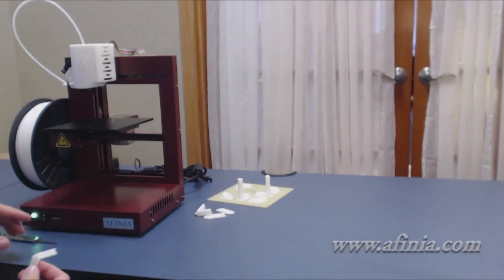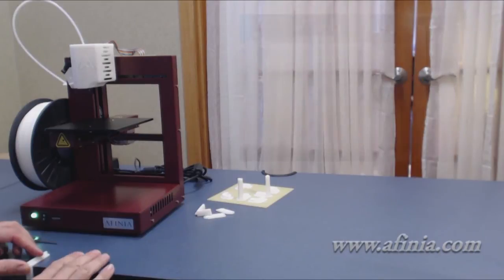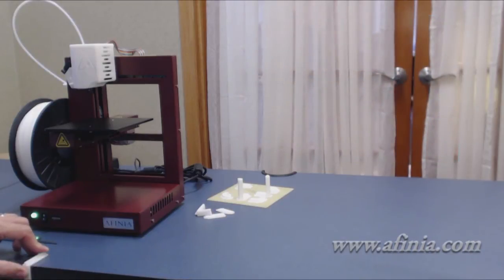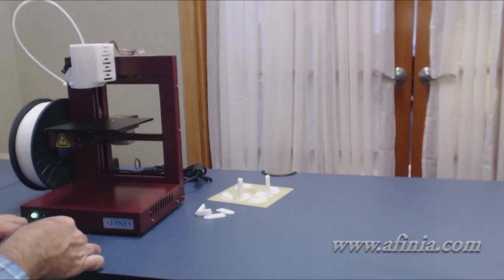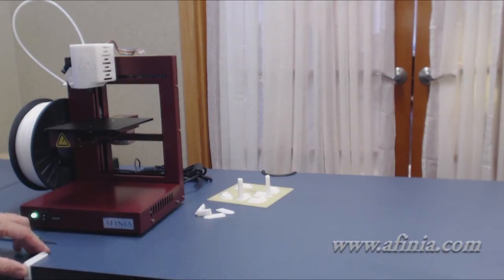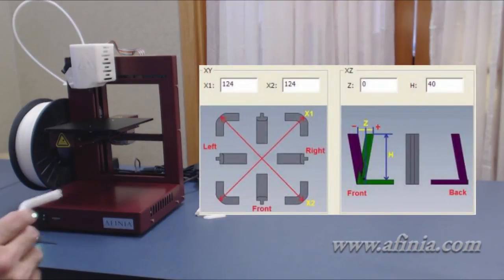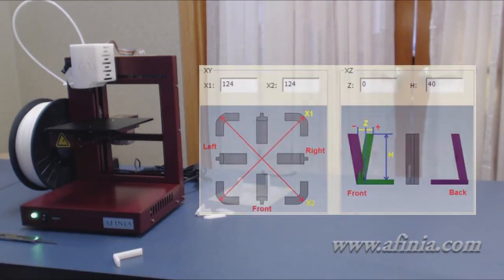This can be a little difficult to do, but you just take something with a right angle — if you've got a square, that would be the best. Place it on here and measure to see if you've got space. If you have a feeler gauge, that might be a good way to measure that space and get the value in millimeters. This one is square, so we don't have to change that value at all. We'll document that and move on to uploading it into the software.